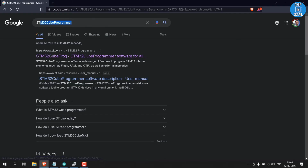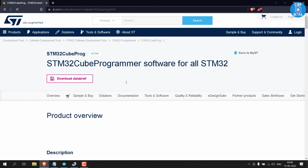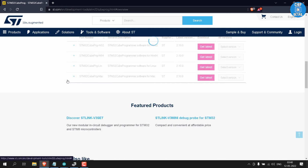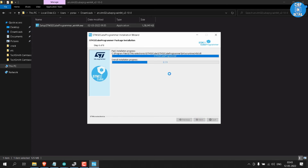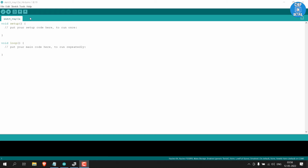This can be rectified by downloading the STM32Cube programmer app from official site and installing it. I have provided the link to the software in the description of the video. Click Get Software and download the appropriate OS version and install it. It is recommended to do a PC restart after this. Now open the Arduino IDE.